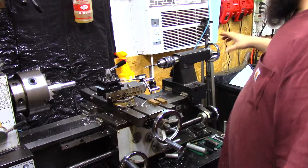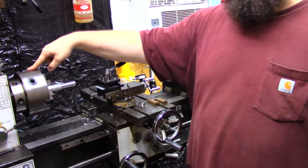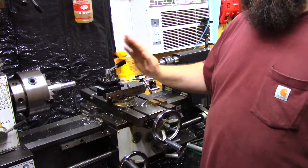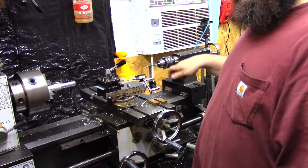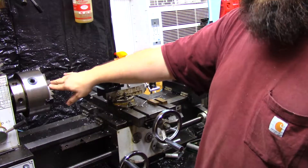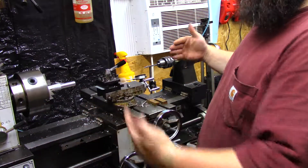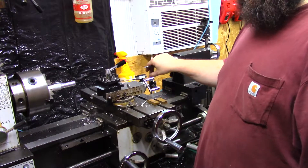Once I have that done, I take a live center in the back, a long piece of metal in the front chuck, run it between centers, and take a cut — a full cut all the way down at say five thousandths, ten thousandths, whatever you want on that first cut — and then you measure it. You take calipers and measure from one end all the way back to the stock. That's going to tell you if this end needs to be picked up a little bit, or let down a little bit. That's how you level a machine: make a full cut and want it to be the same on one end as the other.